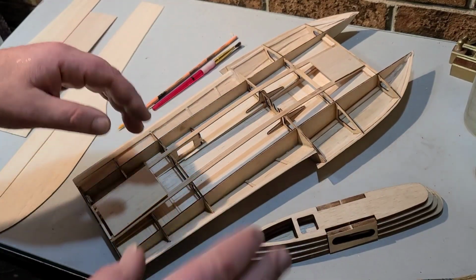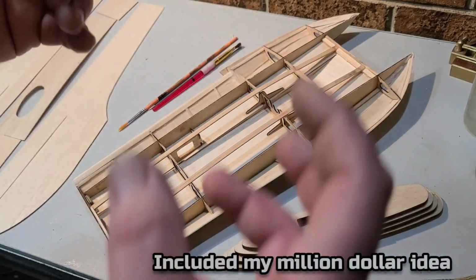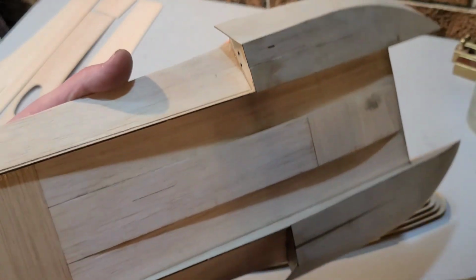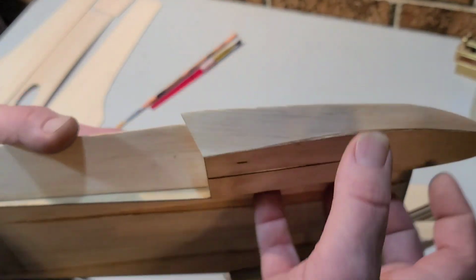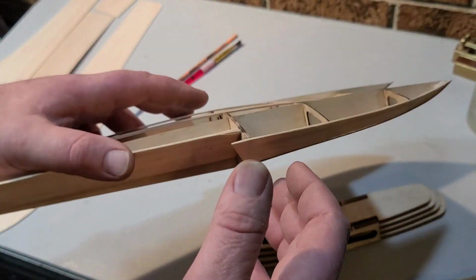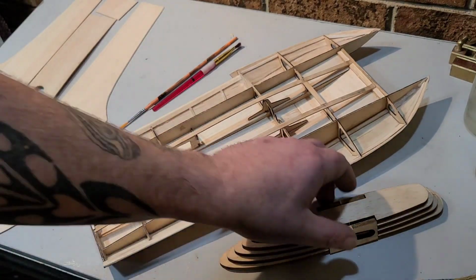Any wood boat needs to be waterproofed, okay? If you don't completely, 100% waterproof the inside of the boat, the wood, you're going to have big problems, all right? The main problem would be water seeping into the wood and expanding and contracting, warping, stressing the joints out. You'll have cracks. The ride surfaces will become uneven, causing poor performance. So this is an important part of your build process, okay?